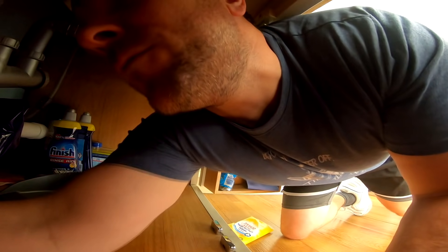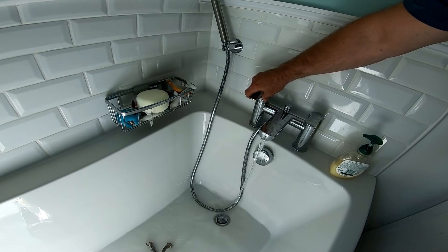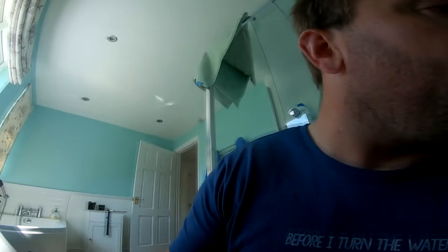So we're just going to go back under the sink now, and we're going to hear loads of water rushing through, but we'll know that we aren't building up loads of pressure where we don't want to. That's back on now. So imagine I'd had those bath taps shut - we'd have built up three or four bars worth of pressure, but we're not actually next to the work that we've done, which is not great. So I can hear water running now because the bath taps are open, but we haven't built pressure yet. It's something quite simple for you to do as a DIYer or as a plumber or apprentice, so you can be near something when it goes wrong, because sometimes things can go wrong.